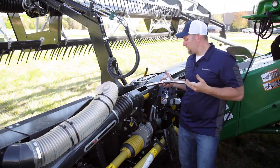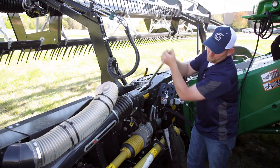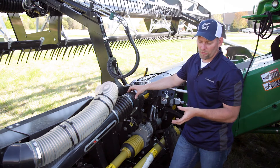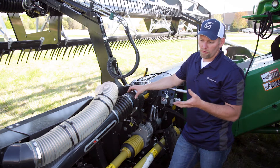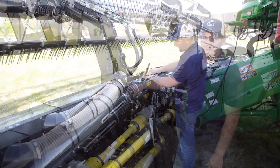We have our three-quarter drive ratchet. We're going to stick it in here, and our indicator is down here. We can increase the spring tension to help carry more weight of the wing, or decrease it to carry less weight. In really rolling conditions, you may have to increase or decrease the wing setting depending on what your wing is doing.